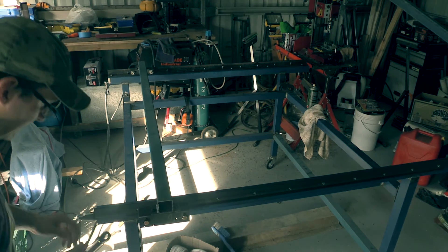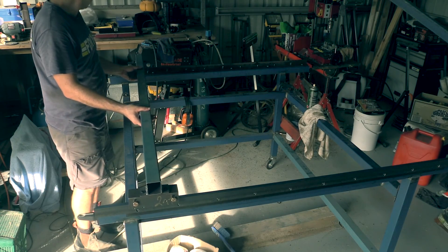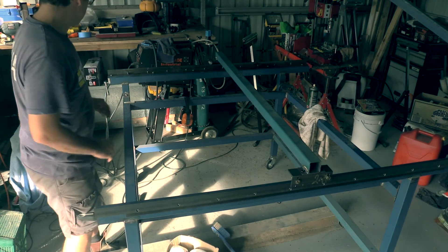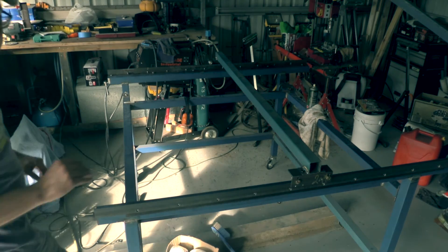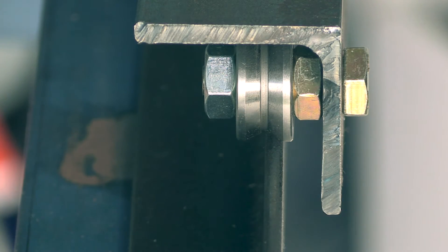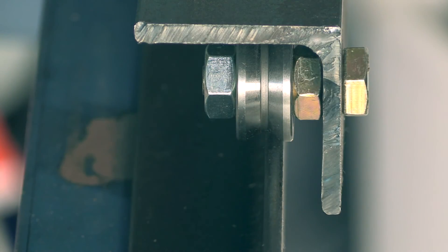Seventy mil, we'll just tighten up these. We're right on the rail now — as you can see, we're sitting on the outside of the bearing. So what I'm going to do is loosen up the rail and push it in a bit so that it centres in the V-groove, and do the same on the other side. We'll just push this rail in a little bit and see how we go. We had a bit of a tracking issue, so I've loosened off all these bolts and now I have the bearings centred on the rail on both sides.